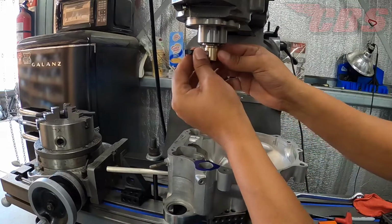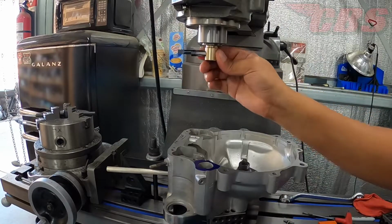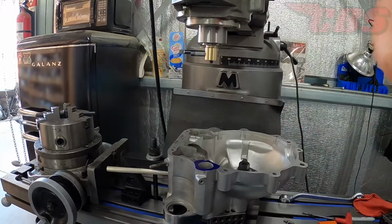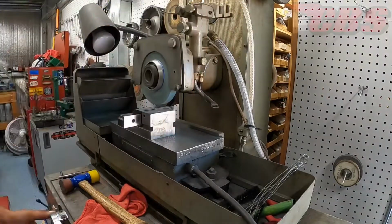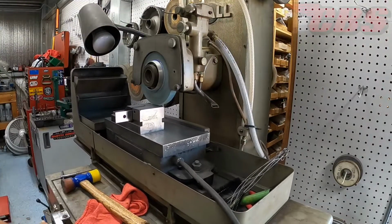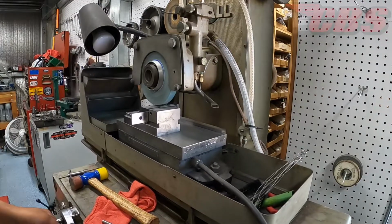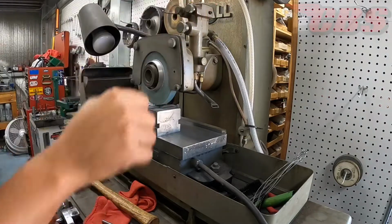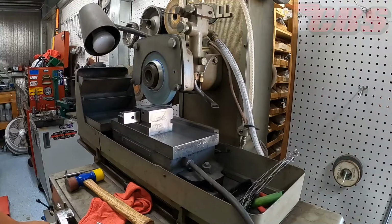So this is the Micro 100 tool, and this is a tool that I made that's in a 3/4 collet. It is a very simple tool that's going to sweep around to cut the O-ring groove. Headed over to the surface grinder, and we went ahead and removed material off the boring bar shank. The reason is because the 3/8 shank happened to be the same or parallel to the actual cutter. So using this tool, theoretically, I cannot cut a groove because the shank itself would be rubbing on the case.